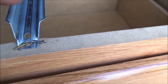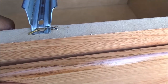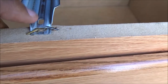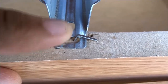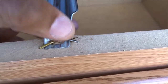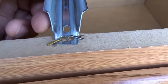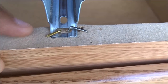So I'm going to have to find another solution for this. I really want to put a screw and a washer there — a small screw and a washer on top to close in that gap. Screw it down and it will keep it from doing this. I've got to find some really small screws and I'm going to have to pre-drill it because I don't want this to split.